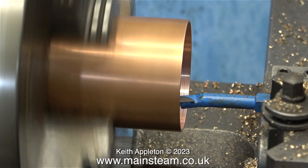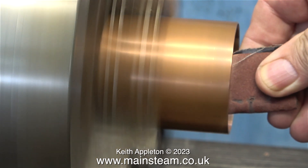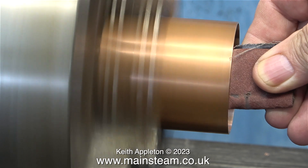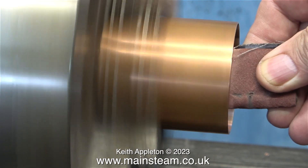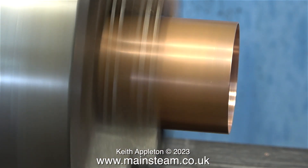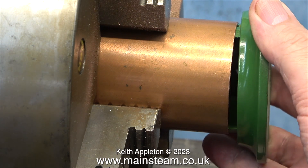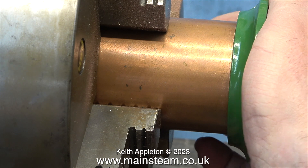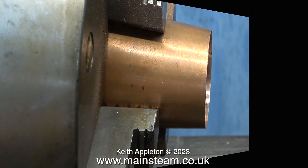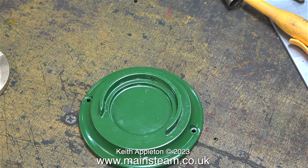I'm using a small boring tool just to reduce the diameter of the end of it. I didn't show the boring operation because — well, it is boring. Suffice to say, I finished off the job with a piece of emery cloth. By using a thick pad of emery cloth folded over, I managed to keep all of my fingers intact. Here I'm checking that the base fits into the recess that I've machined in the boiler, and indeed it does — it's a very good fit. It's just as good a fit as the old boiler shell, possibly a little bit tighter.